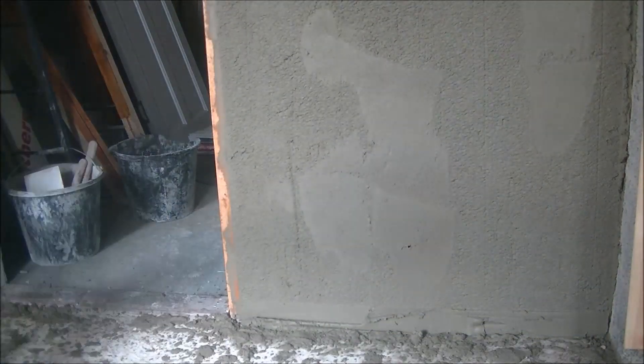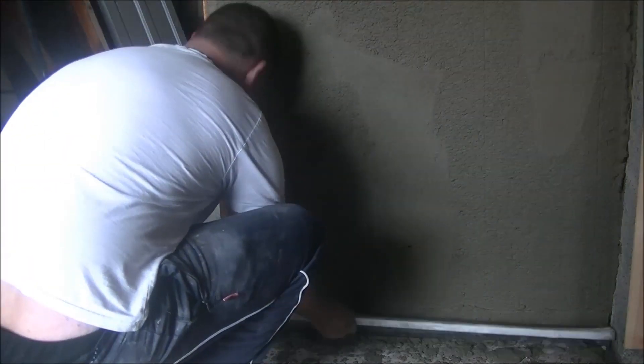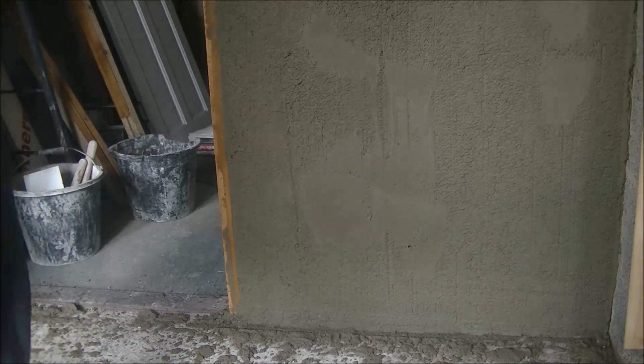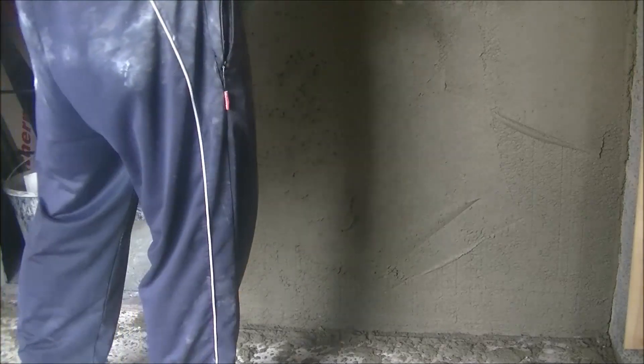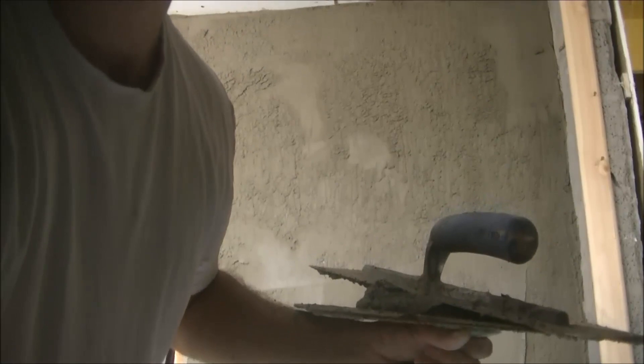You can see the big slacks I'm left with here. When sand-cementing walls, the important areas are all the angles and around the door frame. Also if there are light switches, clean them out and make sure they're nice and fresh around them, because there's going to be a light switch faceplate — you don't want any bumps showing up. The angles will be easily seen. Skirtings — you want them straight because there's going to be a joiner fitting skirtings. Along the top there could be coving or cornice, so keep that nice and straight. Door walls are easier than window walls where you have to set out your own rules.